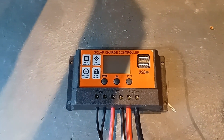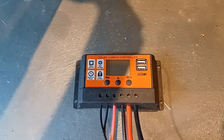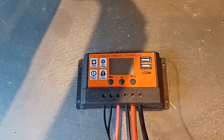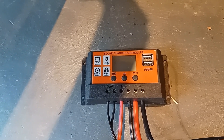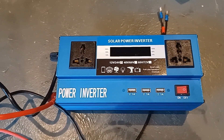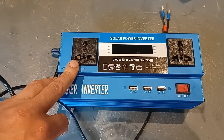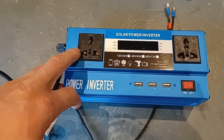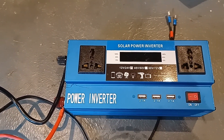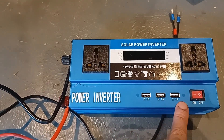I had this solar charge controller spare so I've actually been using that as the charge controller. I believe this has got the facility within it to set the charge voltage by loading and unloading the generator just to maintain a steady charge rate at the correct voltage. And I've bought this inverter off eBay, just so I can use it for something useful. I can plug this into the battery bank and I can power low power items. You won't be able to power a kettle or anything like that, but you can certainly power a light or a radio or something low power like that. It's also got USB ports so I can plug various 5-volt things in as well.